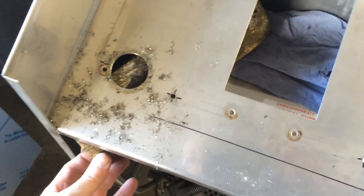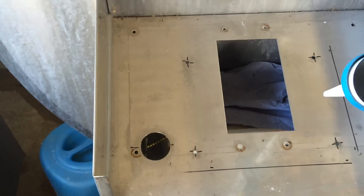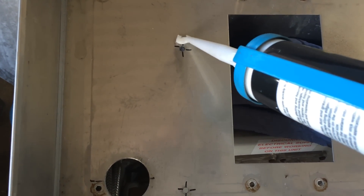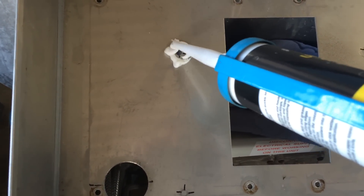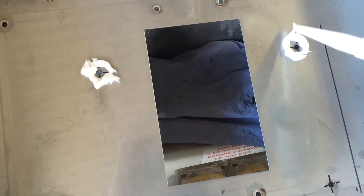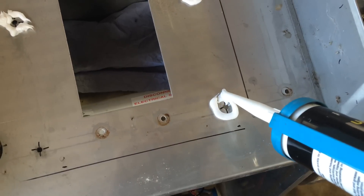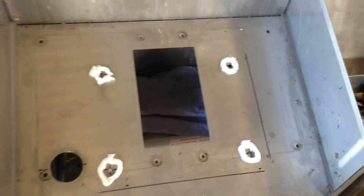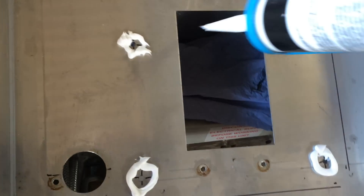I've got the hole drilled through there. I put a piece of wood behind to protect the water pipes on the other side. And that's going to be for our conduit to get through. I've got a hole drilled. I always go around the screws with a bit of silicone — you shouldn't get any water up here, but if you do, it can get in around the threads. That's a bit of cheap insurance really.